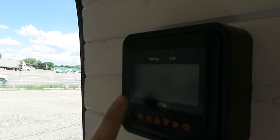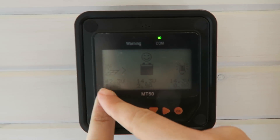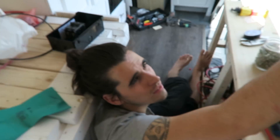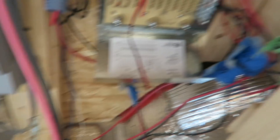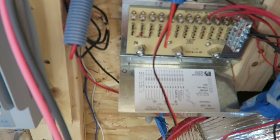It's all positive — we've got the charge controller producing power, we've got our display with a happy face, and we're pulling 42.3 amps. Our batteries are sitting at 14.3 volts — we're almost full! Yay for sun! That was just at 14 a minute ago so it doesn't take too long. It looks like it's a sunny day today. Now I'm just hooking up all of our DC outputs — all those cables are feeding into this terminal, and I'm going to label them — they're all going to have fuses. You've got your positives up there and your negatives going along there, and then that's hooked up into the charge controller which is connected to the batteries. Pretty sweet stuff — getting pretty excited that it's finally coming together.